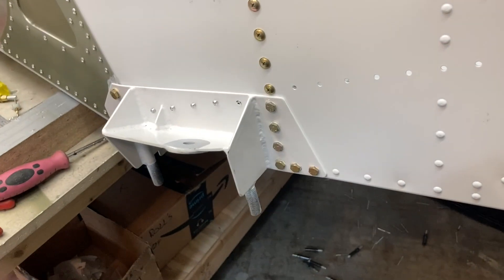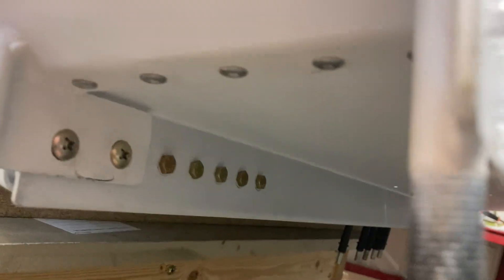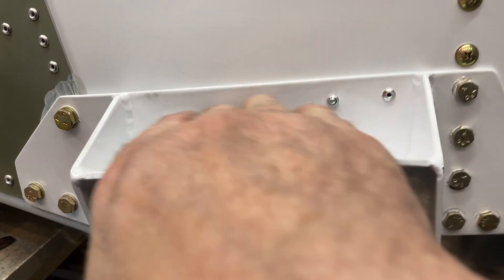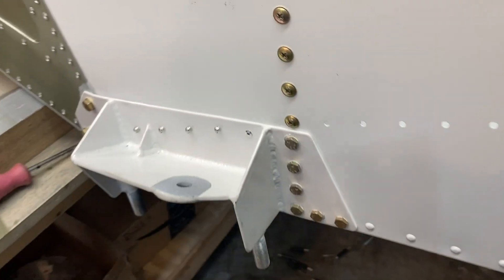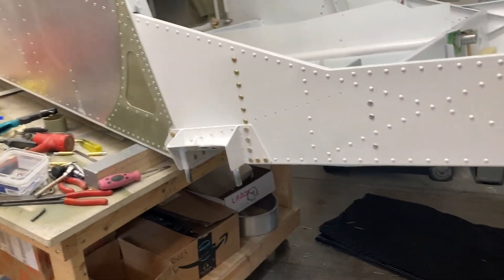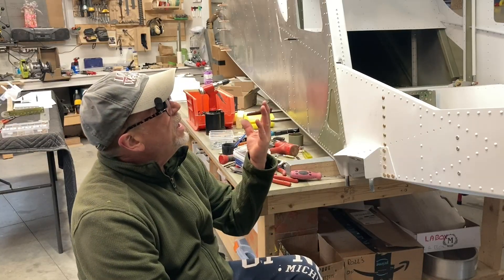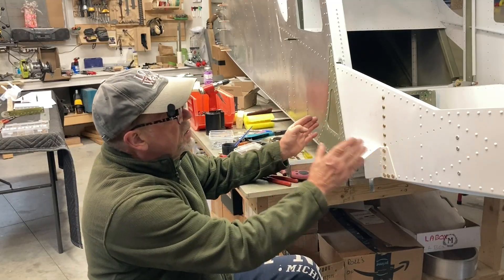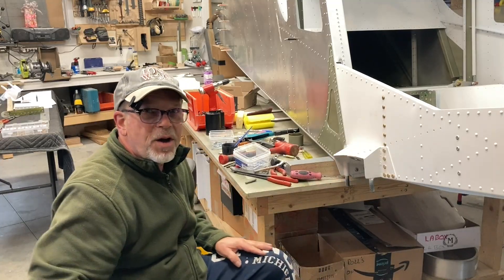The A6s went in really nice once you upsize them. I put that one in this way because I could get a rivet gun in there, then realized it was too steep down inside to do the others — but that's going to be covered and I'm not worried about it. That was it; it took a lot of time, I was really surprised. I just got to put those little A3s in yet and move on to the next thing. I wouldn't have done this without the cage fitting — the cage is all clecoed in, from here back completely riveted. I just got to go to the other side and start on the left one now. Hey, thanks for coming along guys, we'll see you in the next one.